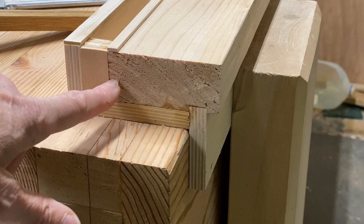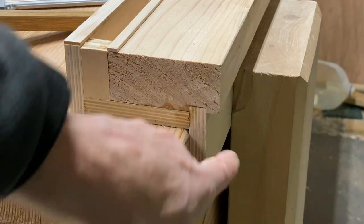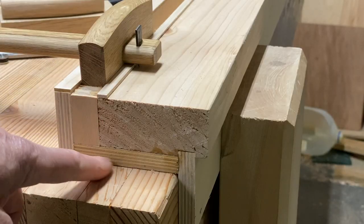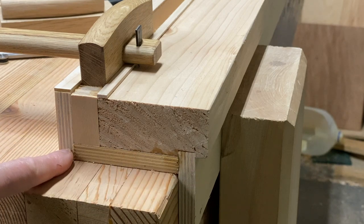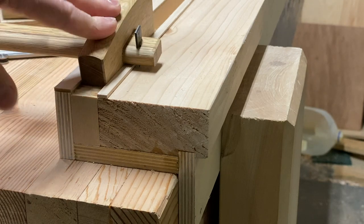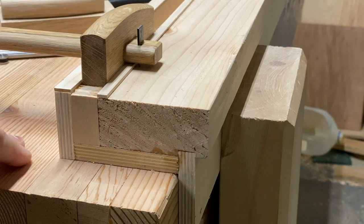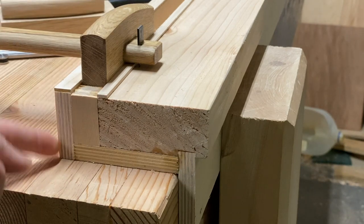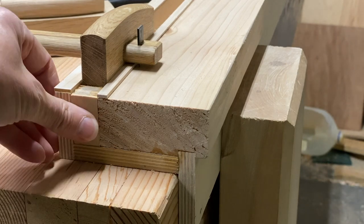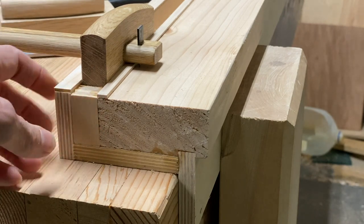The way I made it is I took a 2x4 and routed a groove into it that I put the ledger that fits against my bench and in the vise. The width of this half-inch plywood is equal to the width of the 2x4 plus the thickness of my cutting gauge that rides into this groove to keep everything parallel and perpendicular. Then on the back side I have another piece of half-inch plywood glued against that with a spacer block to ensure that over time this stays nice and tight and snug and in square.